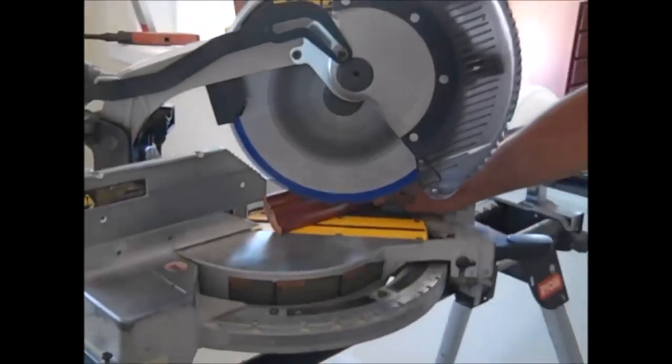The sides of this utility cabinet, there's a sacrificial piece that needs to be put in to take up that gap, but you can see there, and he'll follow the bottom edge of that crown right on that, and there you can see the little shelf for that scribe molding where the bottom of that crown will hit.